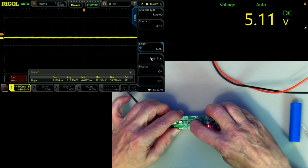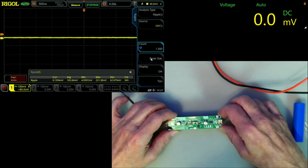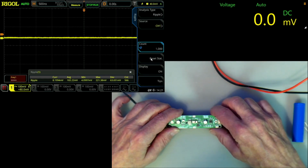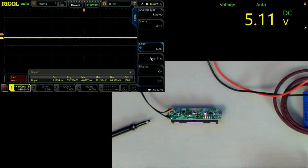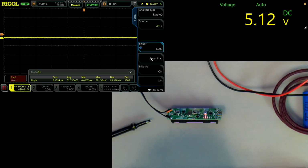Anyway, that is what this thing does, and you can switch it off, and you can charge it through that port there. Okay. So I've got it switched on. Let's draw half an amp, which is more reasonable for when I'm using it in a circuit. Actually, for interest's sake, this is 1 amp, and it can obviously do it. It's rated up to 1 amp. It's still 5 volts. So this is half an amp.